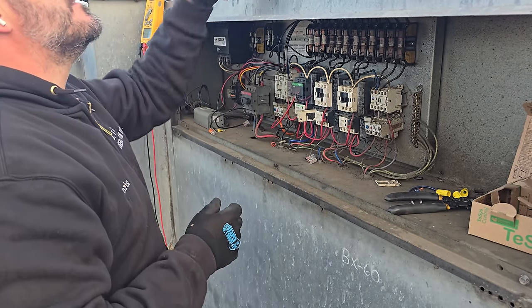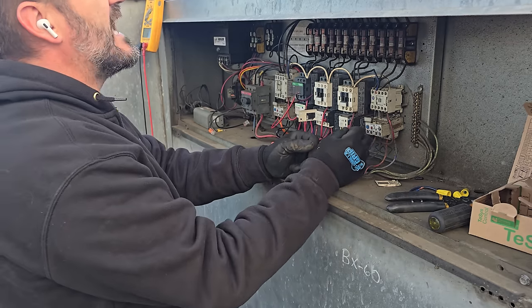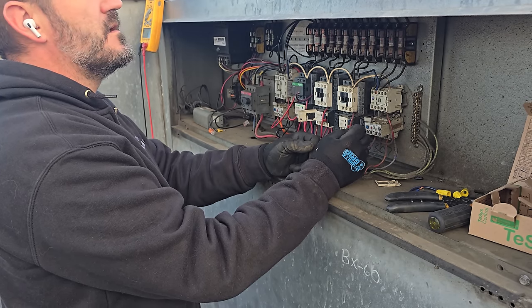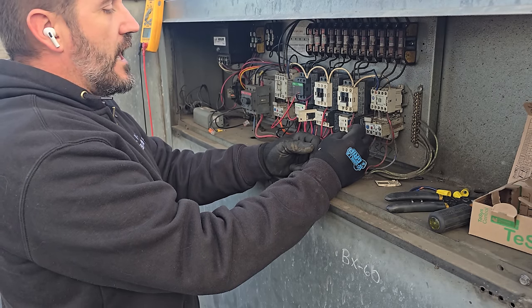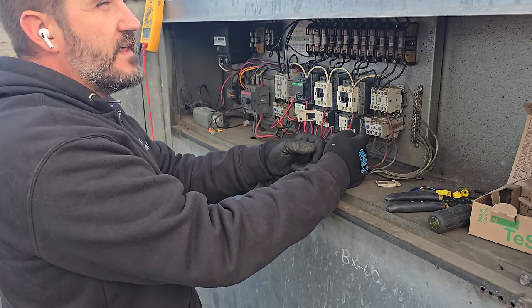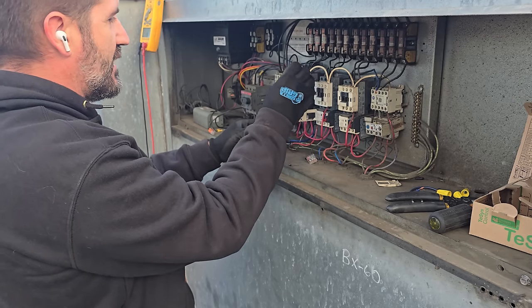What's up, dude? Turning off the system. Okay, is it iced up? The drain pan. Did you see all the water? No, I just walked in. It looks like it's been pouring off the edge. Okay. Alright, I know that we've had problems with the heater in that pan before, and I think we just replaced it, but keep that in mind as you're diagnosing. I don't know if it's a plugged up drain or what. Yeah.